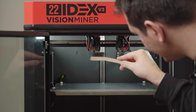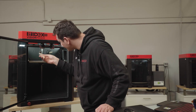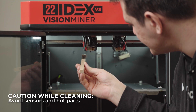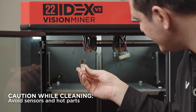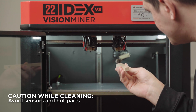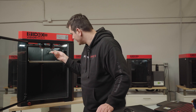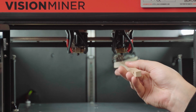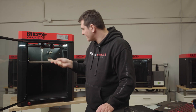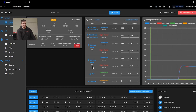They are pre-cleaned after the self-cleaning, but I'll double-check that using the supplied metal brush. I want to make sure that with the metal brush, I am not shorting any components like heaters, temperature sensors, or fans. So I want to be very careful when doing that, not to touch anything, and also because it's hot — just 175 degrees, but I still don't want to touch it. Alright, it's very clean. I select that the nozzles are clean and I have verified that.